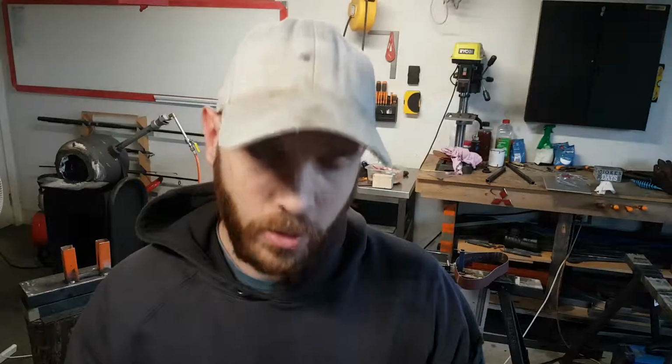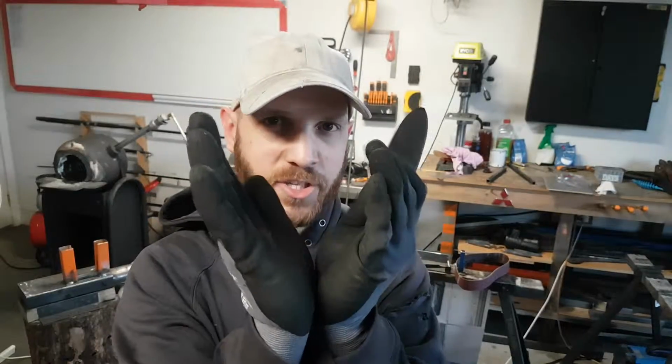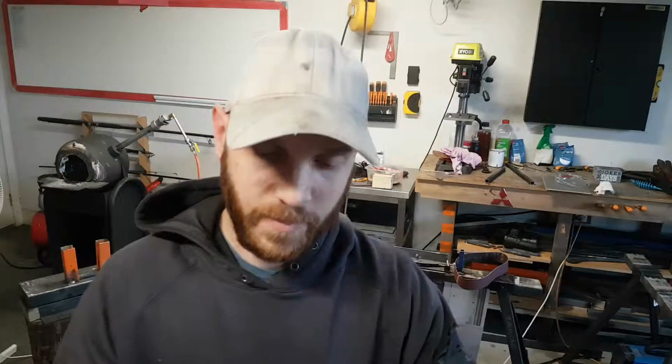So I think they call that the primary bevel, and then the secondary is when it comes in a bit sharper and then meets to make your cutting edge, which you sharpen, or you can do a Scandinavian bevel, Scandi bevel, I think it's called, where you just follow this line straight from the top to the bottom to meet, which makes for a more resilient edge, but it's not as sharp, I think, because it's more of a wedge than it is like a razor. Anyway, I digress.